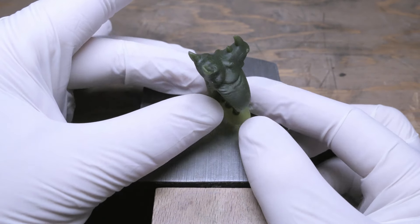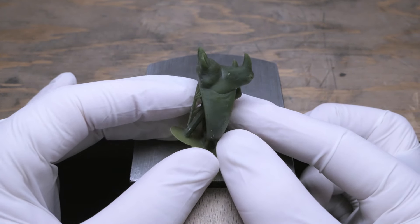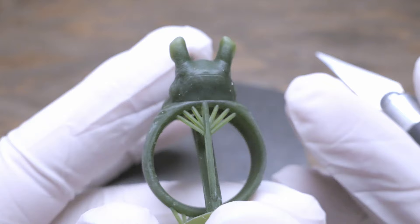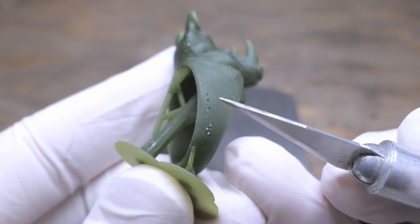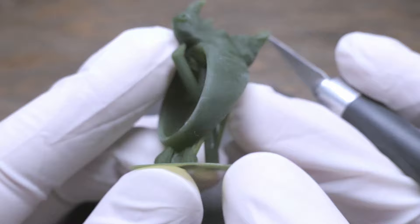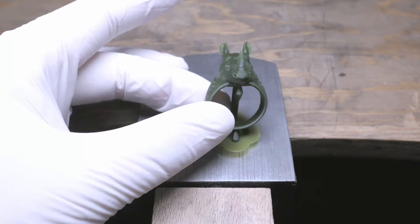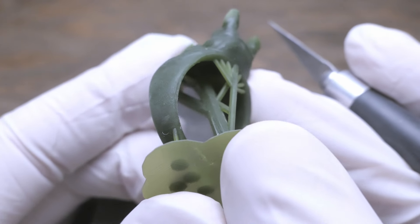Here's the ring print right after a little bit of cleanup, and overall I'm really happy with how this is looking. It has some really nice detail, even with that larger layer height of 0.05 millimeters. The only thing I noticed is that it does have a few small holes and imperfections on the horn of the rhino and over by the band of the ring. I'm not too sure what's causing that — it's possible it could be from debris in the vat or maybe small air bubbles in the resin. After doing some research, I found that I could probably improve this by changing some settings in the slicer software, so I'll have to do a few more tests. But either way, I still think this print should be usable for casting.